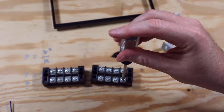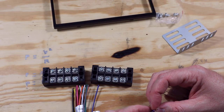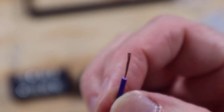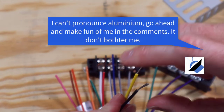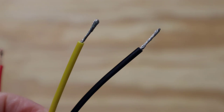Next I'm going to grab some terminals, hook everything up to my bench power supply, and get it powered on to see how it works. The speaker wire is tiny, tiny, tiny — I have no idea what gauge it even is, it is extremely small. One of these is aluminum and the other is copper. The power and ground wires are a little bit bigger, but they're also aluminum. What's the point of switching to a bigger wire if you're going to switch to a conductor that can't carry as much current?